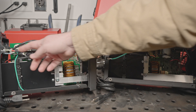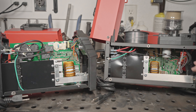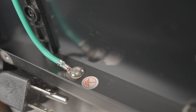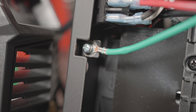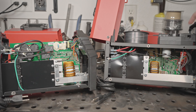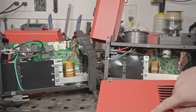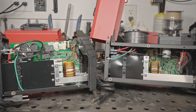A couple of things to note: both of them just have the ground wire coming in and screwing onto a spot on the casement. There aren't additional ground jumpers to go between the different panels or to the outer case, but they do at least take the time to have a paint-free spot everywhere there is a connection point. Even the side panels — on both welders, they've gone through the effort of leaving paint-free spots on not only the inner frame, but also matching inside on the panels that go on there, so you do get a good metal to metal transfer for the ground. So it's not the best ground setup I've seen, but they've gone to a little bit more effort than some of the welders I've seen.